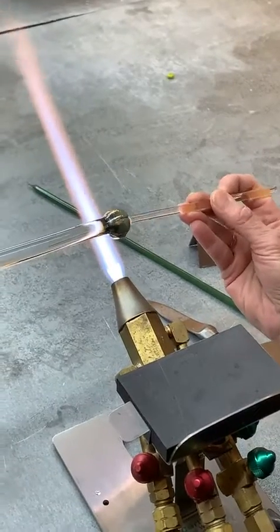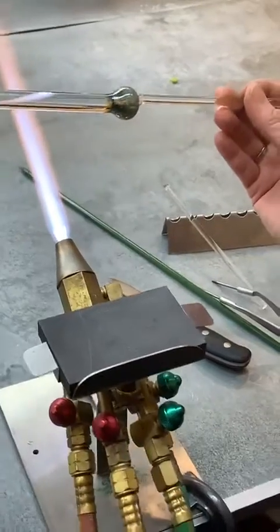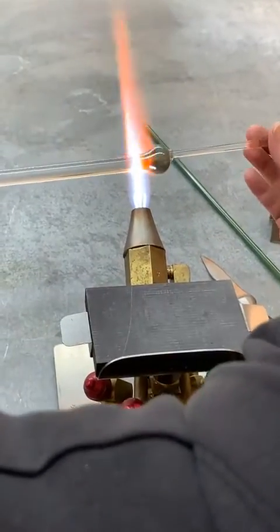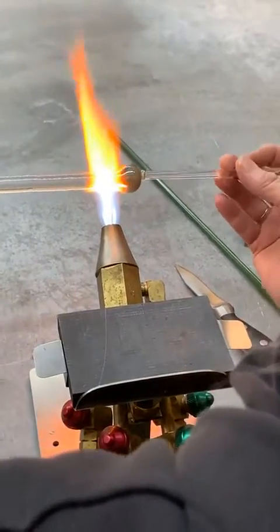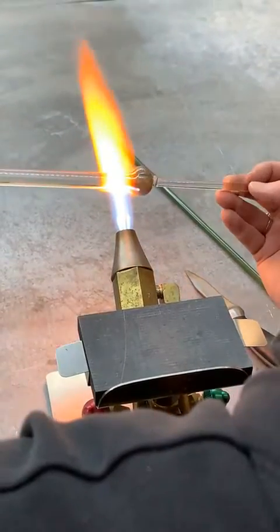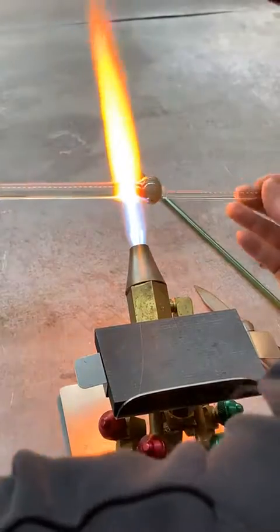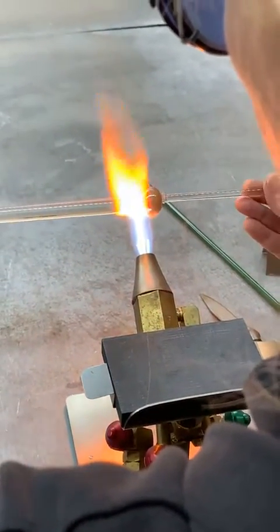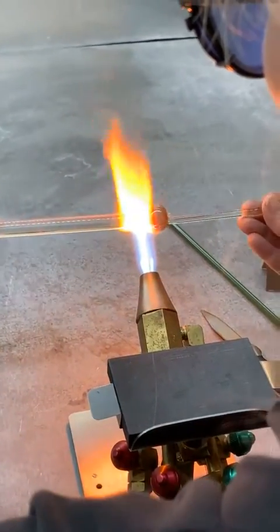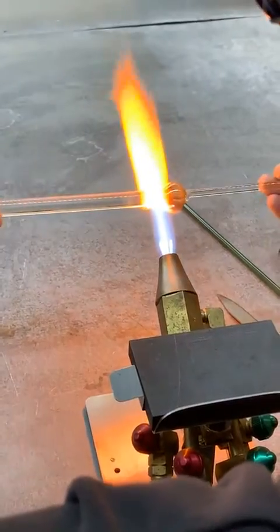So I'm trying to make what I call like a cold seal. So that's really not real stable. So once I take this off and I'm working from this, I have to be a little careful so that I don't bump it and have it drop. So I'm just going to concentrate my heat at the top of that pumpkin, just to be able to start to separate it. Helena, this is borosilicate glass that Val is using for this particular project.